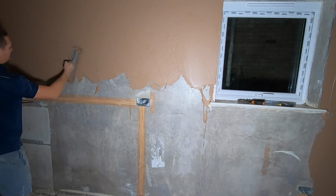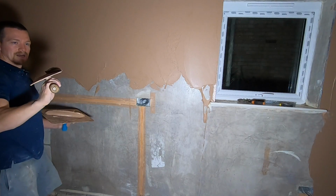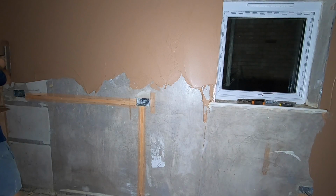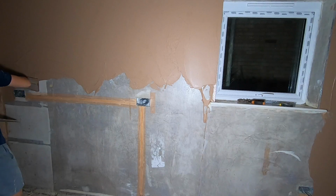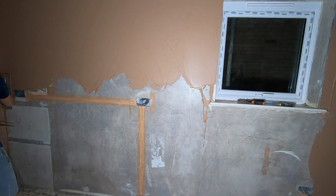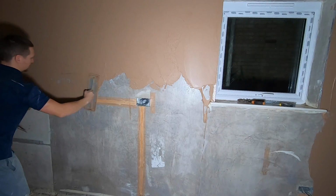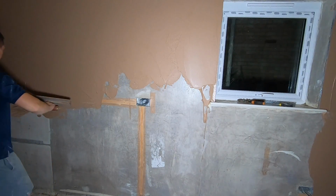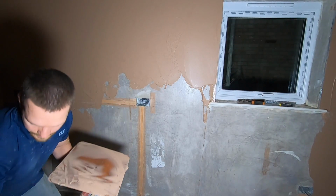We're going to start to the left, same process. Bring the plaster to the left side of your trowel, dig it into the corner and come across. Now, sideward sweeps are quite hard to get used to at first, but they're essential in plastering, so worth practicing. Take care around your back boxes. And you're just putting a nice, generous application of plaster on. Go all the way to the bottom. Load up.